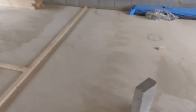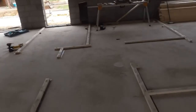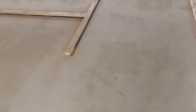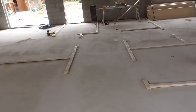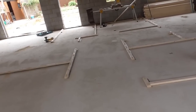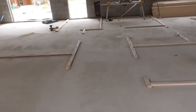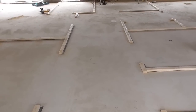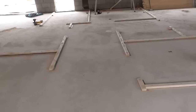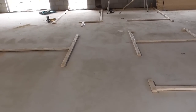It's only a two bed of this, and although it's a really big shell, it's being built specifically for someone and they only want two bedrooms. So the one thing that we found really important on bungalows like this, although it looks fairly airy and open at the minute, we've got quite a wide entranceway hallway here. What we found in the past, if you try and squeeze them down too much, when you walk in here initially, it can seem like you're walking into a tunnel. So we widen these out a little bit, and it just makes it feel a little bit more spacious when you walk in. Not particularly an issue on this bungalow, as I said, because it's been built for someone, but if you're trying to market a bungalow, the last thing you want to do is people walk in the front door and feel like they're hemmed in.